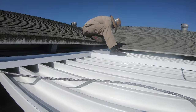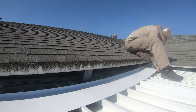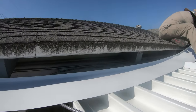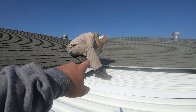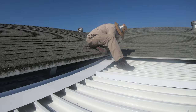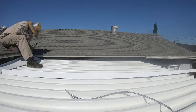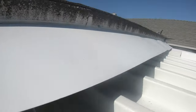What we're doing right now is we're installing flashing on top of the wood rafters on this house so that when the water hits, it'll flow down right into the panels without ever having to worry about any water getting back behind. We're trying to McGuyver that side over there since that roof is a little bit lower than this one, making the flashing best suited for both roofs so everything flows this way and then this way. Flashing is installed — we used three-eighths-inch sheet metal screws to hold them up, so all the water will just hit here and then go right into our panel.